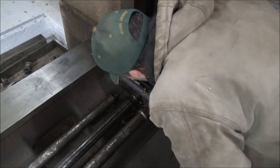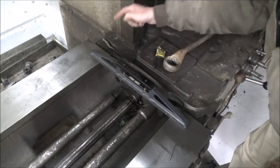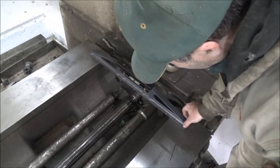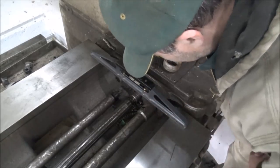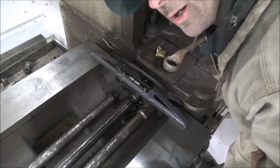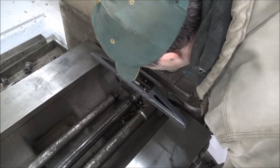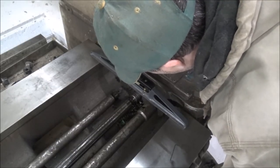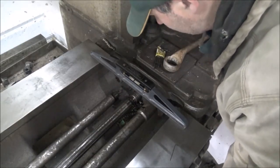Currently I'm showing three lines plus center, which would be 15 arc seconds - it's showing high on that end. But if I pick up this end and sit it right back down - I'm not touching it - now I'm showing it's two arc seconds the other way. So it's moved, depending on how you look at it, three divisions on that end of the bubble - 15 arc seconds off. It's sitting in the exact same spot; all I did was change which end I picked up.